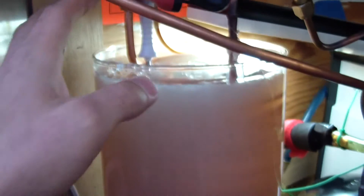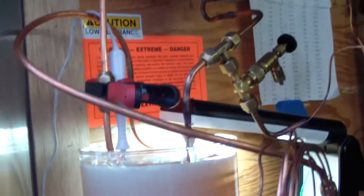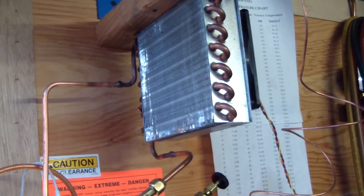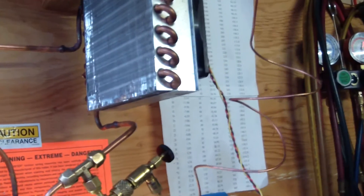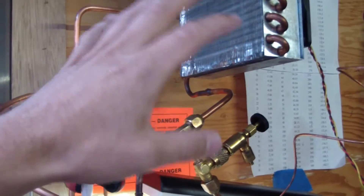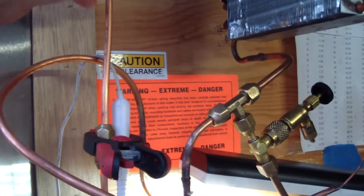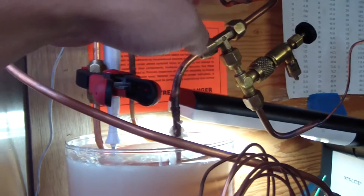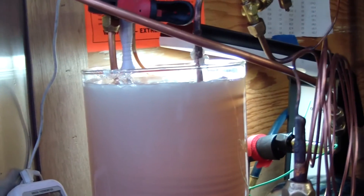During the run cycle, the system melts all this paraffin, and we have a thermosyphon — something I've wanted to build a practical, useful version of for a while. This is an air-cooled condenser, completely separate refrigerant loop, completely passive except for the fan. There's no pumping action of the propane — all pumping in these lines is passive, it's a bubble pump. There's a certain amount of liquid and gaseous propane sitting at saturation. I didn't want to use a glass tube with vinyl tubing for a sight glass since those are notoriously leaky and I've had one pop from too much heat.